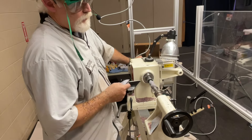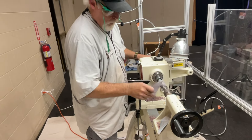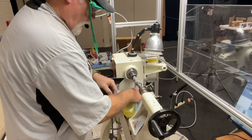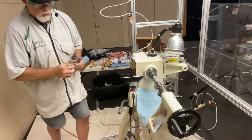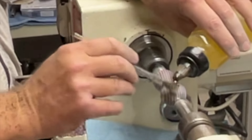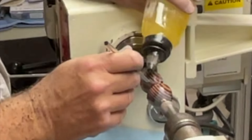Once the lacquer is on, it's pretty stable. I have a bunch of finished stoppers in this little half-log display here — feel free to look at them. I usually just put paper towel right there with a magnet to hold it, because I've got fans blowing in my shop all the time. This is a gloss deft — I don't really pay attention to whether it's gloss or semi-gloss. I'm putting this on as a sealer coat and it really makes the colors pop.